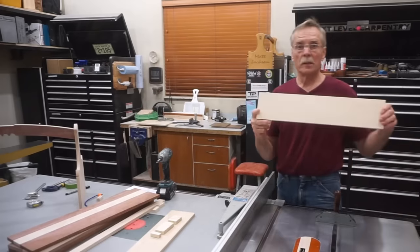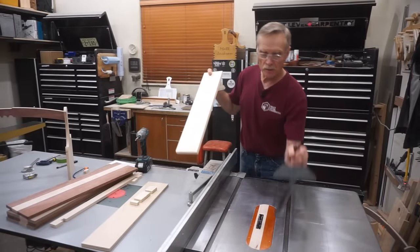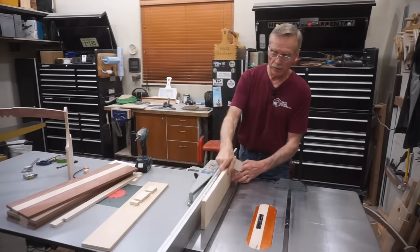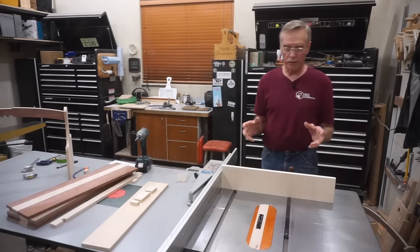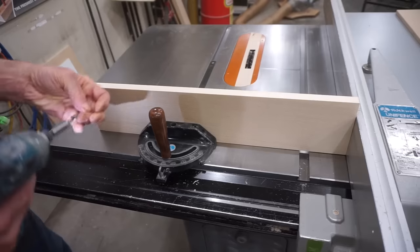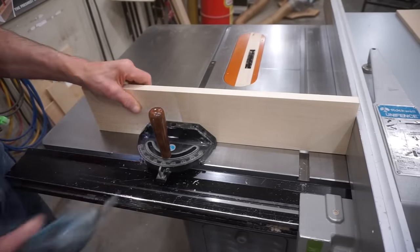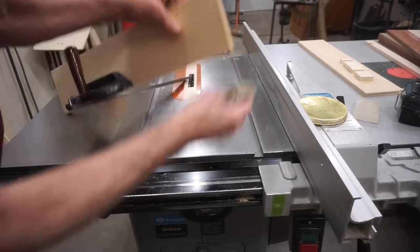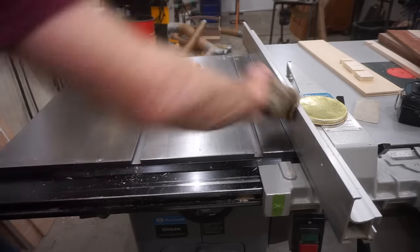And then this piece of wood gets attached to a simple miter guide for the table saw. And it goes without saying that this piece needs to be straight and flat. And with those things dialed in, I just run a couple of 1.5-inch square drive screws through the back of my miter guide and into that block to hold it securely in place during this operation. Once the auxiliary fence is attached to the miter guide, I put a generous coating of paste wax on all the moving parts so that it slides freely and smoothly in use.